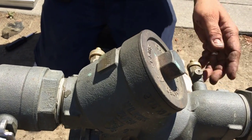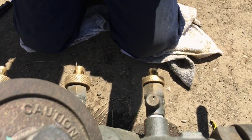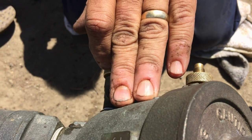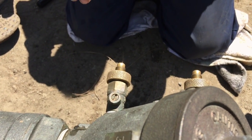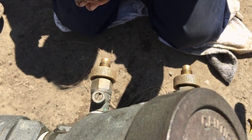Now, if there's an issue with the valve — if you've got a leaky number two check with back pressure on the system, the relief valve will actually open and dump. If you've got a problem with the number one check valve, unless there's a problem with the relief valve, the relief valve should be opening to the atmosphere. What that does, it actually releases that water and brings in air to break any vacuum between the two.